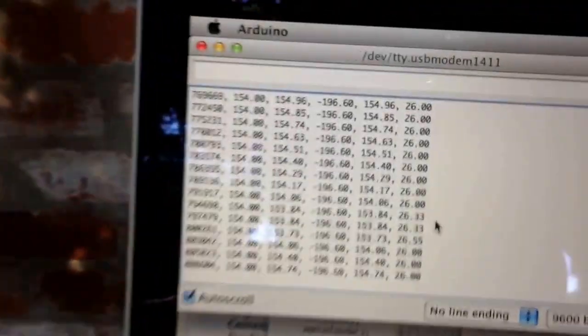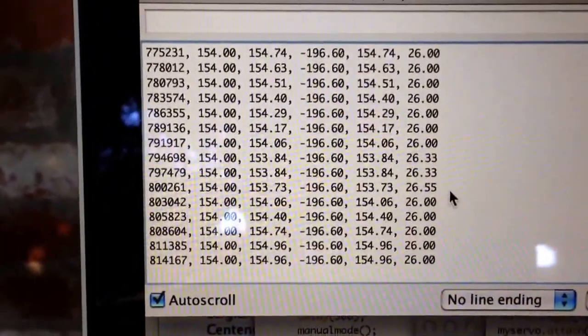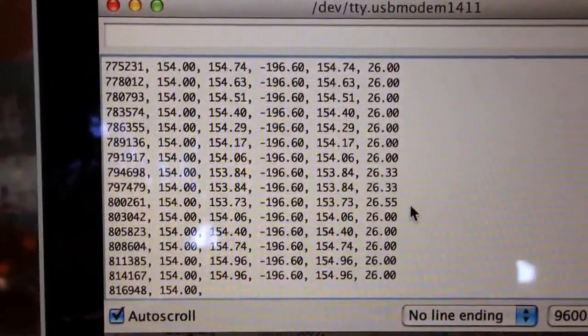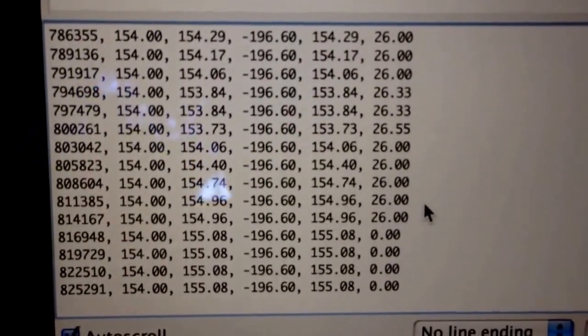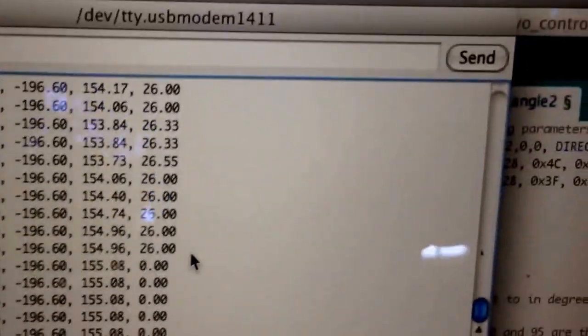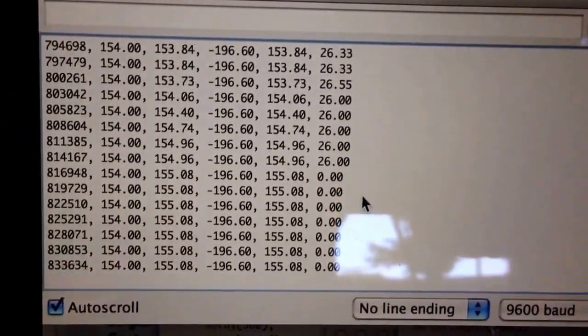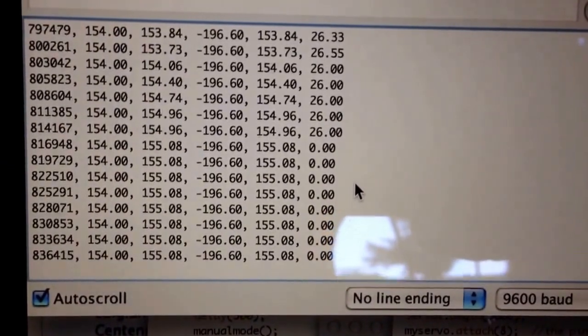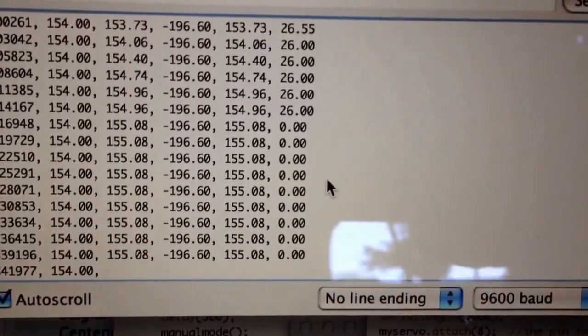So it may be making some very small adjustments. If we take a look at the output of the terminal here, you'll see it's right at the lowest level. It just switched itself off so that it can hold 154 degrees. It's got a 1-degree dead band, so it switches itself all the way off at 155 degrees. But under that, the PID takes over. This helps limit my overshoot — as you can see, I'm about at 0.08 overshoot there.